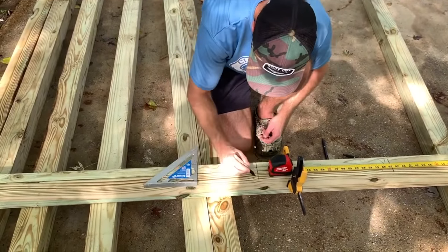I'm cutting it to size just like we did for the other two, and then I'm dry fitting it in place just like we did before. Then I'm gonna apply construction adhesive as you can see me doing from the inside there. And here's a look at the bead of construction adhesive we applied to the half inch overhang from the inside view of the shed. As you can see, just a nice little bead around the entire perimeter.